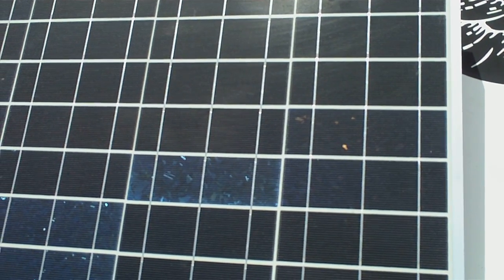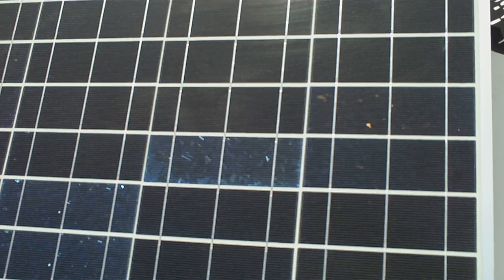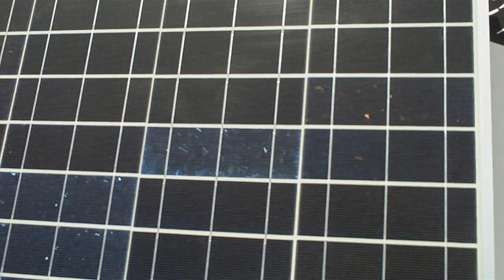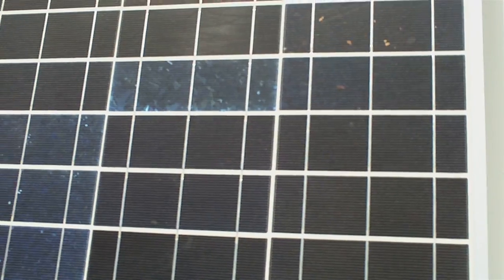Normally for the off-grid market, the photovoltaic cells that are used are rubbish. They're just the offcuts, the lowest quality cells, and they get thrown into these small panels because they think that no one in the off-grid market will notice. Kyocera Solar is distinctly different. Every single photovoltaic cell that they manufacture comes off one production line. Every panel, from their smallest, like this one, right up to their biggest, the 210 watt grid connected, uses the same cells. That's critical. It means that all our off-grid customers with these Kyocera panels get the highest quality performance in the market.